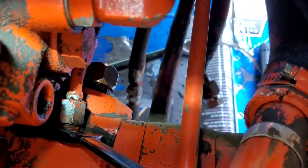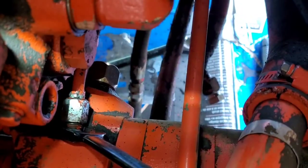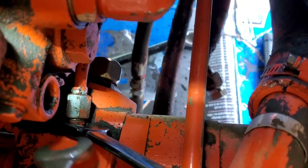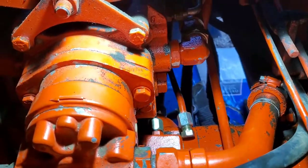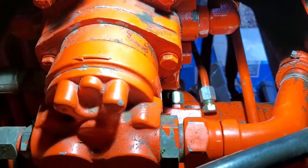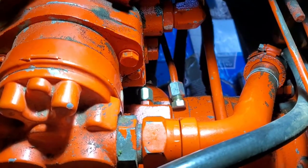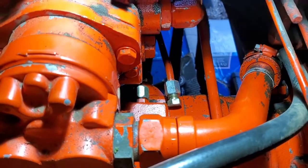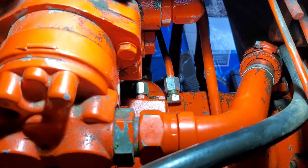You're just flopping your wrench around to get a little bit of a turn on it. That's the only drawback of skid steers — everything's in such tight spots. I got the drain line off and capped it, but the threads start a little bit too late on my cap so it couldn't quite get all the way on. Make sure your plug has more threads in it.